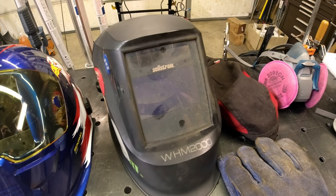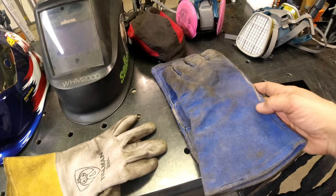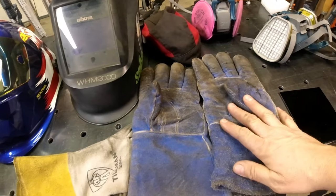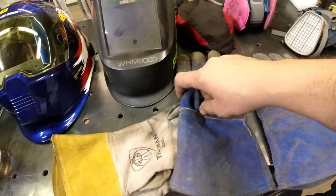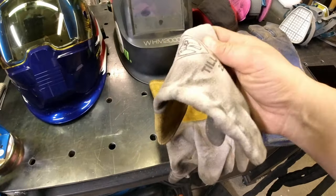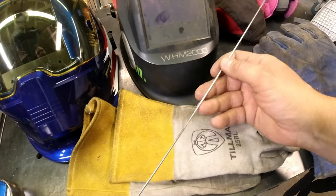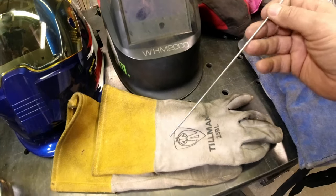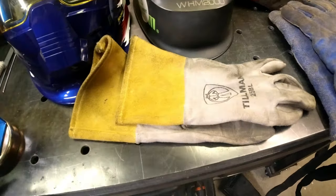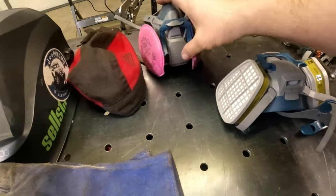You're going to need some kind of gloves. If you're stick welding or MIG welding, typically a heavier style glove because your hands are right there dealing with a lot of heat. If you're TIG welding, these are very thin gloves — it allows you to hold and feed the thin filler rod. You really can't do that with thick heavy gloves. Different process, different purpose.